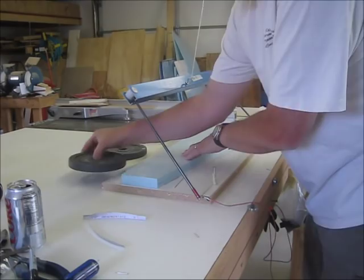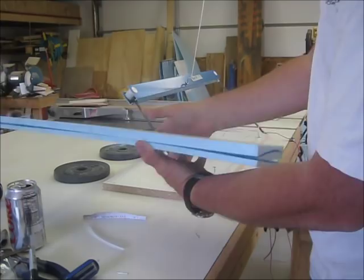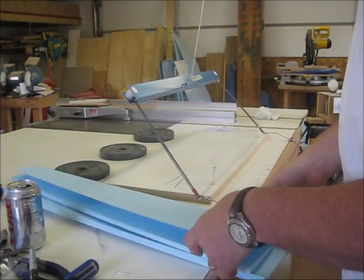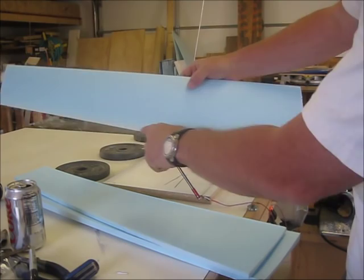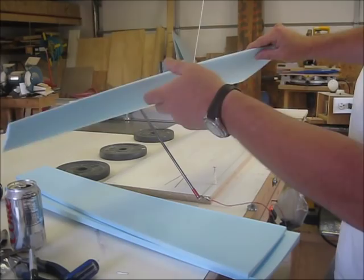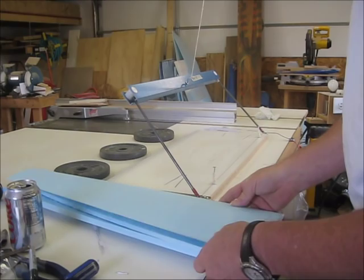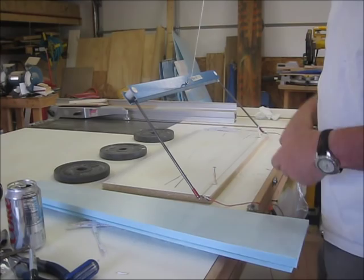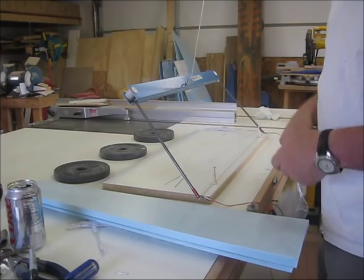Let's pull this out and take a look at the wing. And there's your wing — at least half a wing. Pretty good trailing edge, nice straight trailing edge, a little burnt here but not bad. Airfoil looks good, leading edge looks pretty good, trailing edge is good. There's half a wing. The other side is done the same way — just flip the piece over, move your templates around, change the way the wires pull, and that's it. Then you've got your cores for the wing.